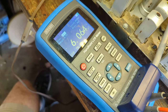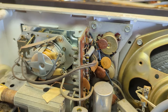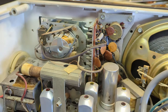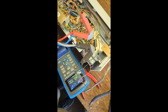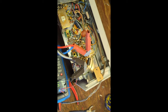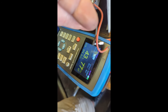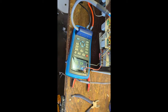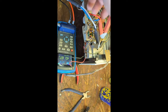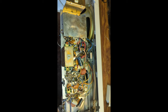I'm going to test a few more electrolytics. This one's super bad and it's also off the volume control, so that could definitely have an effect on sound quality. The only other electrolytic tested good — very low ESR. Since this is a low voltage cap and this meter is for low voltage electronics, I'd trust that it's fine, so we're going to leave that cap alone. The rest of the capacitors in here are all ceramics, so they're fine.